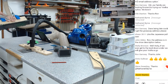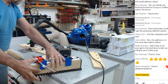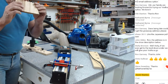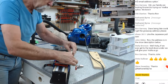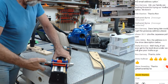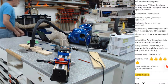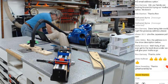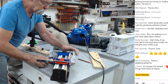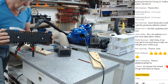Turn him off. Cole's H10, I think it is. H10 jig. And I've got a tiny dovetail cutter in there that's for his H10 jig. Let's put this in. Camphor laurel, if you could only smell this. Drop that in there. I'll get another clamp because that's the way you're supposed to do it. I can do it with one, but if something was to go wrong, it's not worth mucking around. Using a machine, use it how it's supposed to be used.